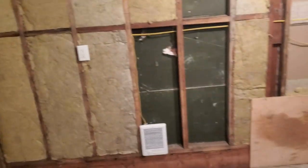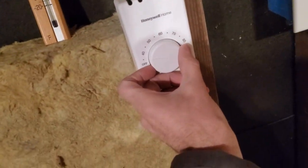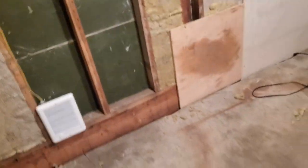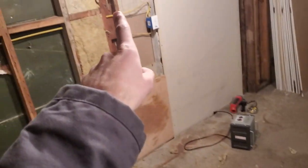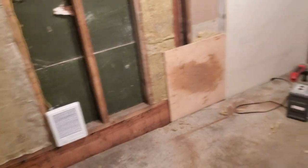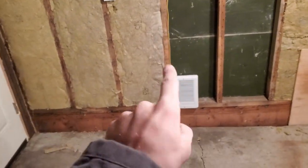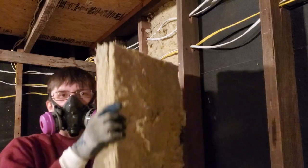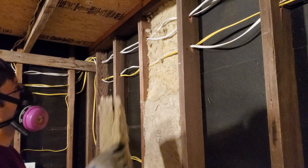Today's the next day. As you can see, I've got this section insulated except around the heater. We just got the power hooked up to it — grand finale. Let's turn it up to 45°F... and she just came on. There was a little bit of minor burning smell, I think from dust from the insulation getting in there. We're going to let it heat up the space and then resume work. Theoretically I could double the heat output by plugging into my separate outlet circuit for 3,000 watts, but I'm going to let this bugger do the work. If it can raise the temperature in this uninsulated space, it won't have a problem once it's insulated. I sliced a batt in half to get it behind the wire.